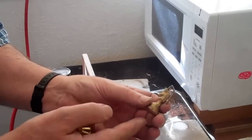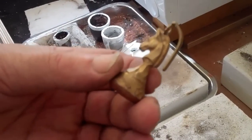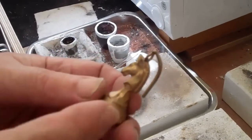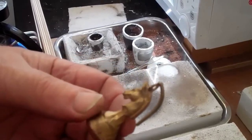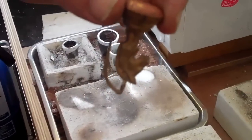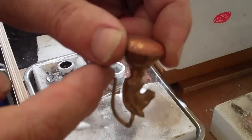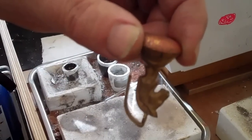In the micro foundry you'll perhaps recognise one of the charms that we've been casting using gravity casting. These little charms come out nicely because they're a fairly simple shape and it's easy to vent — being cast in this way, easy to vent the air from the bottom up towards the input, towards the ingate.